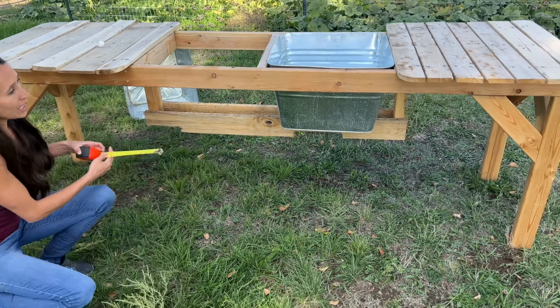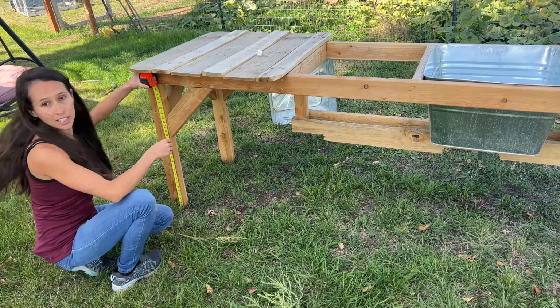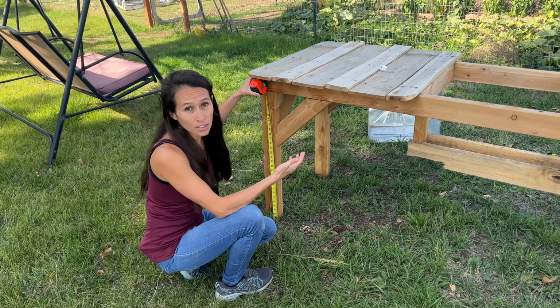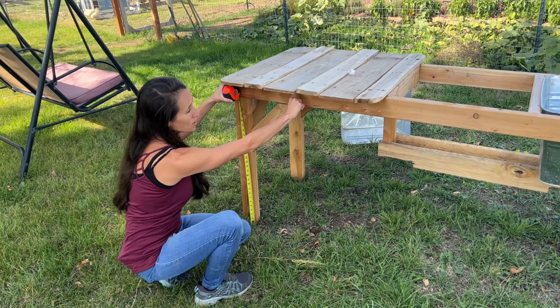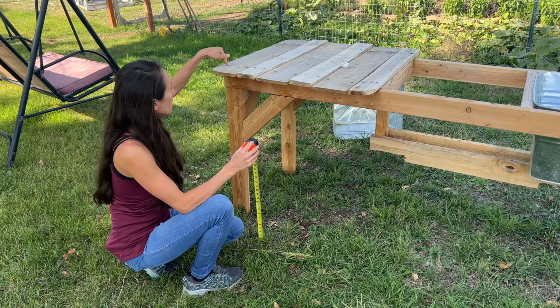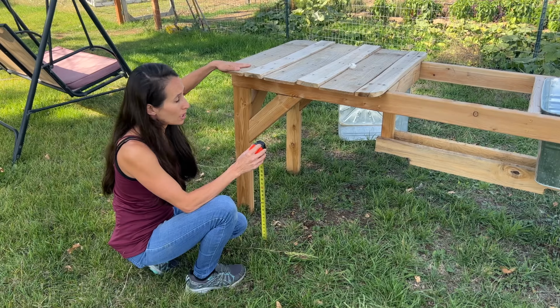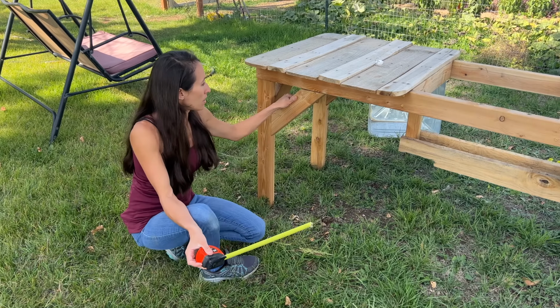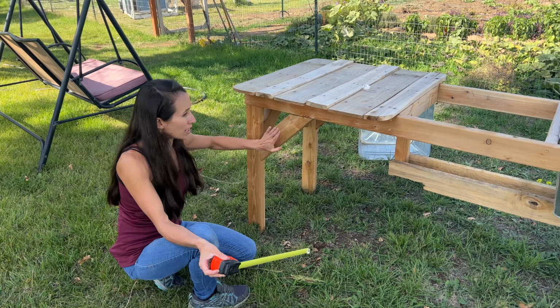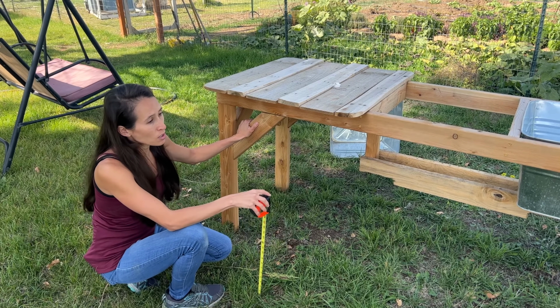And our legs then were screwed on next, and these are 29 inches down. All the 2x4s are placed on their sides, so you're going to have your 3.5 extra inches from the 2x4 up above it. When we put this together, we actually did screw these legs in from the top before we put the countertop on. And then everything was sturdied up with some diagonals, making a couple of triangles along each leg, and it is pretty sturdy. And so far, so good.